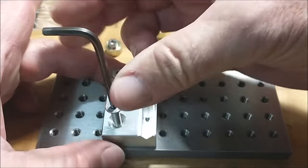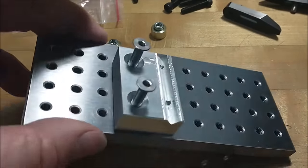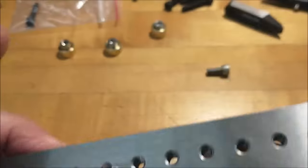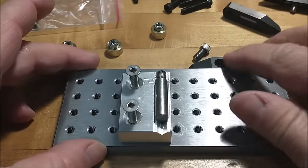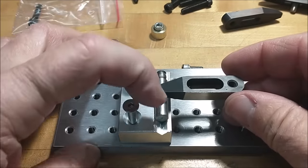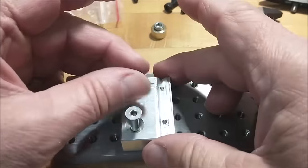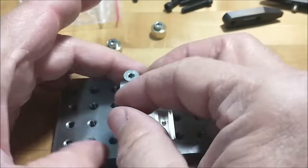Here's how that was done. I screwed a piece of aluminum to the plate, kicked the plate up at 45 degrees, ran an end mill across it, and now I have a V-block true to the world. The part was then positioned in the V-block, clamped with one clamp in the center, and I was able to drill the holes comfortably and repeatedly. Screw a block to your plate, machine the block — that's now your fixture, take it in and out of the machine as you see fit.